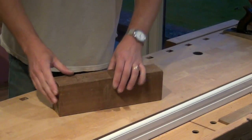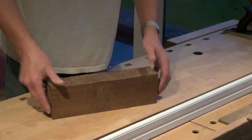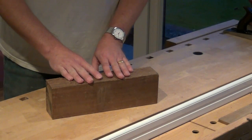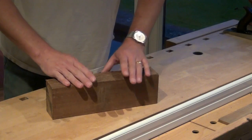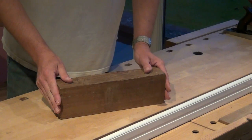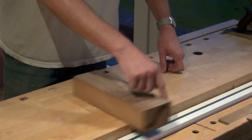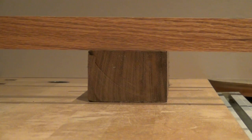I should be demonstrating on this smaller piece. This is a piece of Iroko - it's actually going to be quite a challenge because it's got a lot of wild grain in it. But we're not too worried about getting a smooth surface straight away; we're looking at getting flat sides, flat edges, square to each other and with no twist. This has got a bow to it, as you can see it spins round quite easily. The tri-square blade touches the wood still leaving a large gap up near the stock, so this blank certainly isn't square. We can also see clearly that it's in twist.